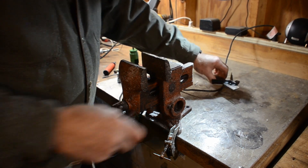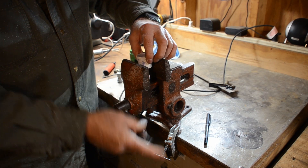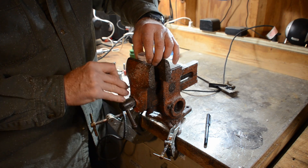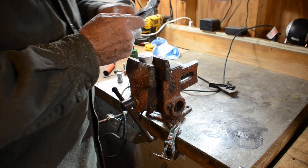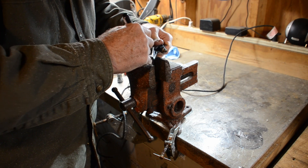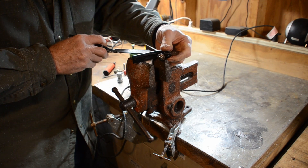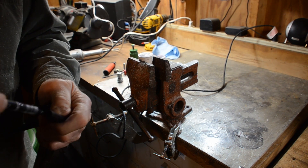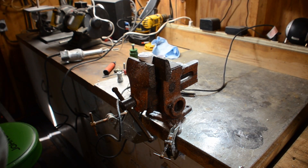While the PVC pipe with glue and cement is setting up, let's go ahead and go to the next piece, which is going to be the top. We're going to find the center of this piece and we're going to drill a 5/16th hole and tap it 3/8-16 for a bolt. I just want to get close to center — see the intersection there? That should be the center. I'm going to go ahead and prick punch it, then set up my drill press and show you how I drill it.